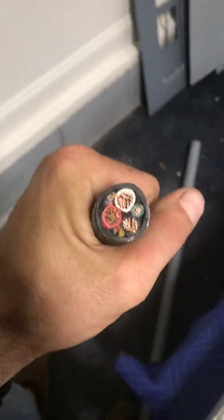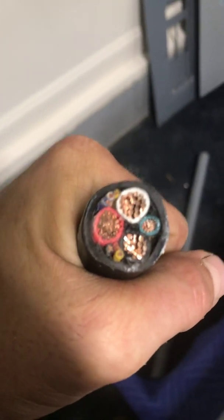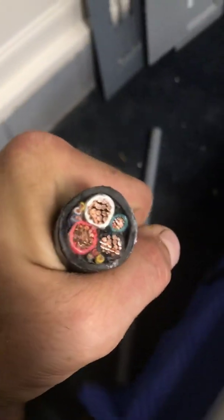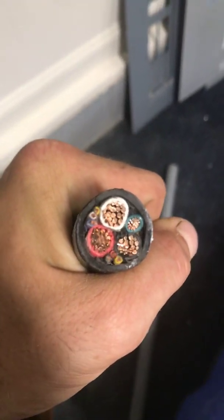Wiring this is not as easy as it seems, but Southwire has come out with a cable that has all your low voltage included. There are six conductors in there — low voltage conductors — and then your feeder cables: ground, neutral, and two hots for 240 volts.